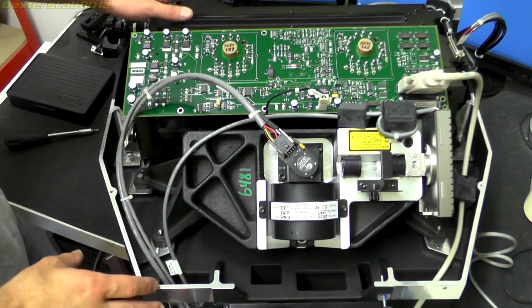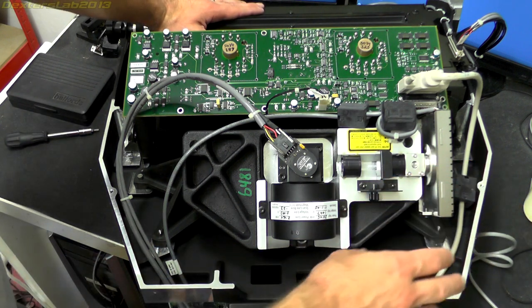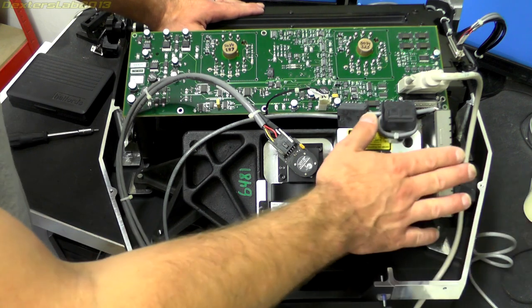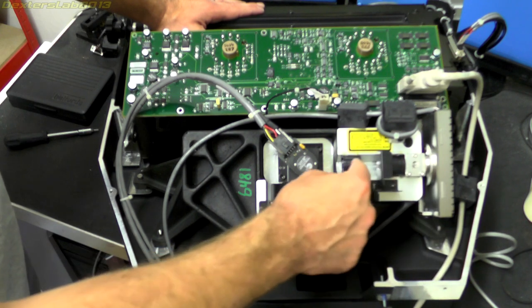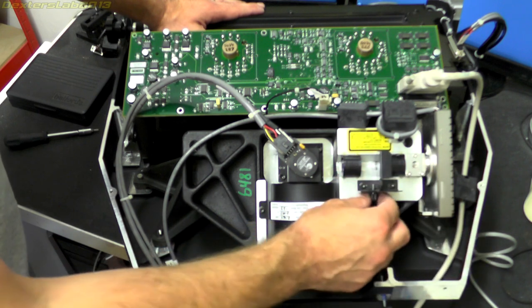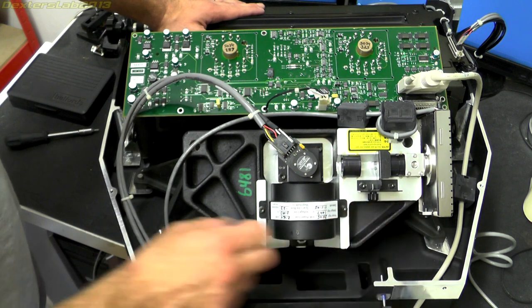I can speak a little bit about how these actually work. Down at the base here we have the slot where the imaging plate comes out. The way that these actually detect the image stored onto the imaging plate is they scan a red laser across it. That's this unit here - there's a laser module here. The optical path that comes through here has a couple of lenses. There is just here a little filter that can be placed into the beam line - that is there for servicing, so if anybody's working on this with the laser on they can move this filter in front of the laser beam to actually reduce its intensity, to make it a little bit safer.